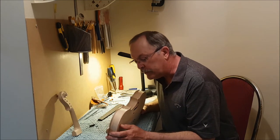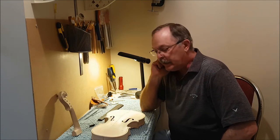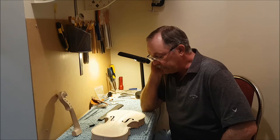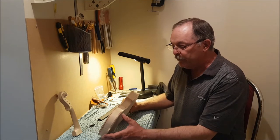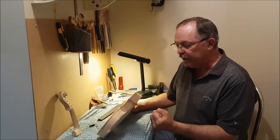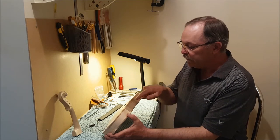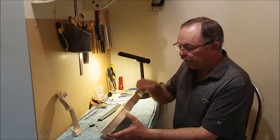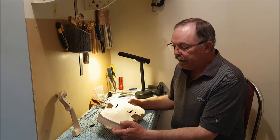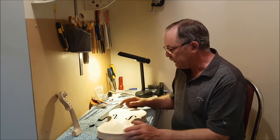While we're speaking about cracking, what we use in violin making is something called hide glue — an animal-based glue made from animal hide. It's a very strong glue, but it's also very brittle. Its holding power is very great, and one reason they use it is that you can actually take the violin apart easily if you have to. It will break if you hit it — it's brittle — but also it's used so that the glue will let go before the wood breaks. That's one of the reasons they use hide glue.